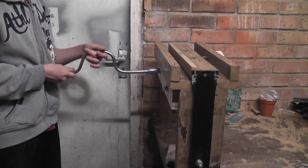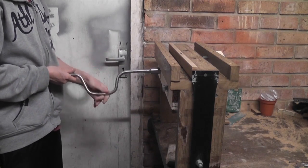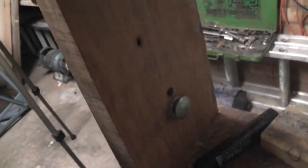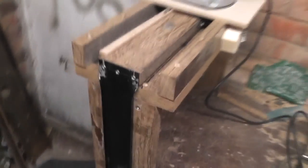Now, as I do up one of the bolts here, watch the top table. You'd simply expect the bolts to force the table sideways, but in fact, because it's mounted on a pivot point 12 inches away, this causes the top table to swing at a 12-inch radius.